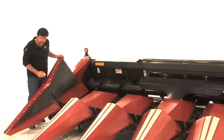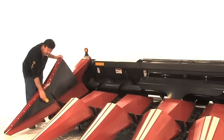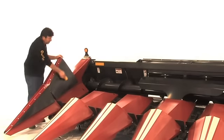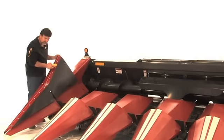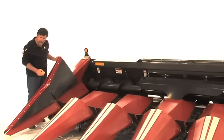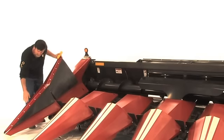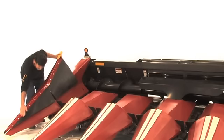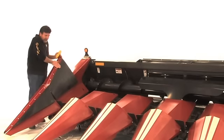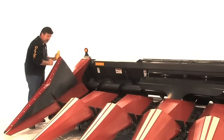This tall corn shield option actually does 2 things. Does a great job of protecting the ear from being lost way down here by the snoot, let alone clear up on the side. It's adjustable for height. But another feature that is overlooked a lot of times is that in intermittent down corn, when we have a few corn stalks that are laying over, this actually works extremely well to start lifting and standing that corn stalk up, so it's more likely to go into the corn head than to be lost over the side or hung up and lay over the lateral bonnet.